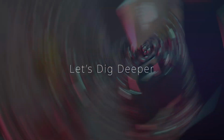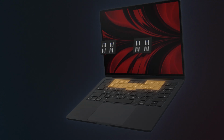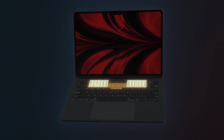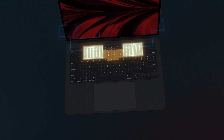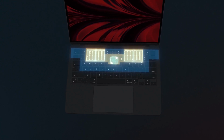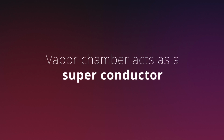Let's dig deeper into how these 4 AirJet Minis are designed into the notebook. First, a thermal solution subassembly is created with 4 AirJet Minis mounted on a vapor chamber, 2 AirJet Minis on either side. Second, the notebook PCB is shaped to accommodate the subassembly while ensuring the vapor chamber handle rests on top of the hot processor located at the center of the PCB. The vapor chamber acts as a superconductor, transporting heat from the processor to the 4 AirJet Minis.